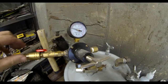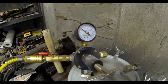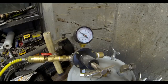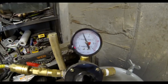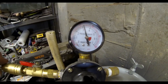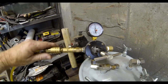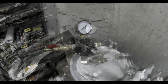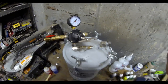Once I turn on the valve, you can see the pressure start to slowly increase. I want to bring this up to about 45 PSI. On these pressure tanks, especially the converted ones from Harbor Freight, it's a little scary to go above 50, so I keep them right at about 45. Then I turn off the valve and, as a safety precaution so no additional air pressure can get in, I disconnect the compressor from the tank.